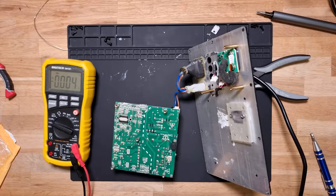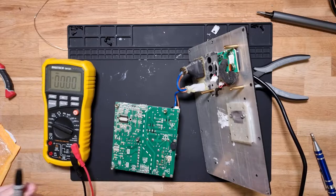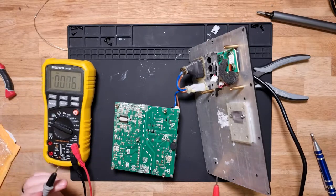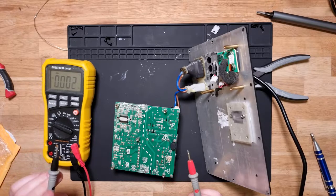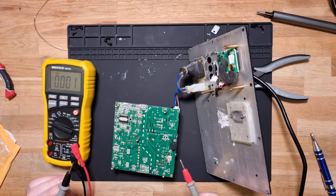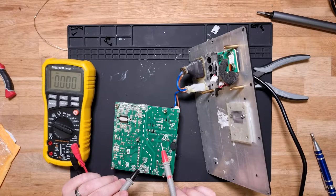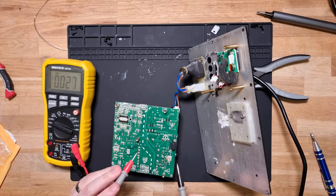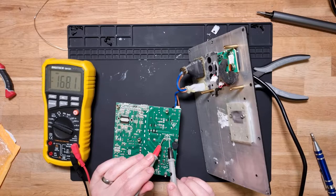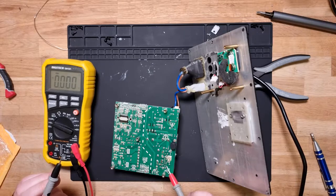So let's double check that again. Yeah, we should get our 330-ish or so volts. Yeah, typical bridge rectification from 240 to 325, 330, something around that range. So our caps here, that's our positive, so this will be our ground of these caps. So they're charged up to 170 volts, 170, yep. And then it should be coming over to...